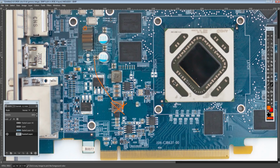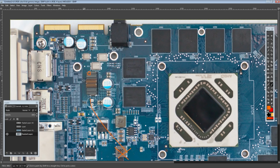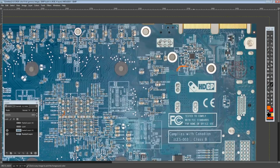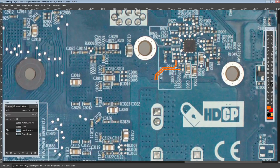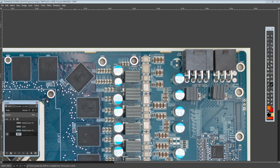Then we're just gonna grab roughly 0.95 volts from over there. So we're just gonna run a wire like that. Then this starts complaining that I'm pulling too much current. So we gotta fix that now, don't we? And so instead of doing the reasonable thing, I smack a resistor on top of the current monitoring, and bam. Card now runs. This is super, super sketchy. But it does run, so I'm pretty happy with it.